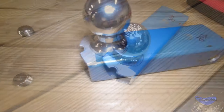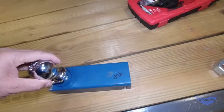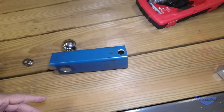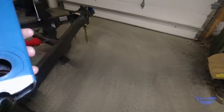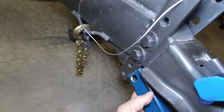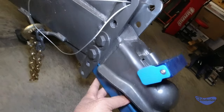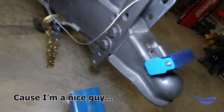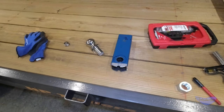I'll weld it across here all the way around, and then I'll weld it here. When all of that's finished, I'll cap this end off and you won't be able to get to it. Finally, there will be a piece coming straight down and that will make up the difference. This hole here is going to line up with this hole here. When that's in here, theoretically it has the ability to tilt, which it really doesn't. But I'm going to put a piece down here anyway, and that will block that hole. I need to get rid of some paint and start welding.